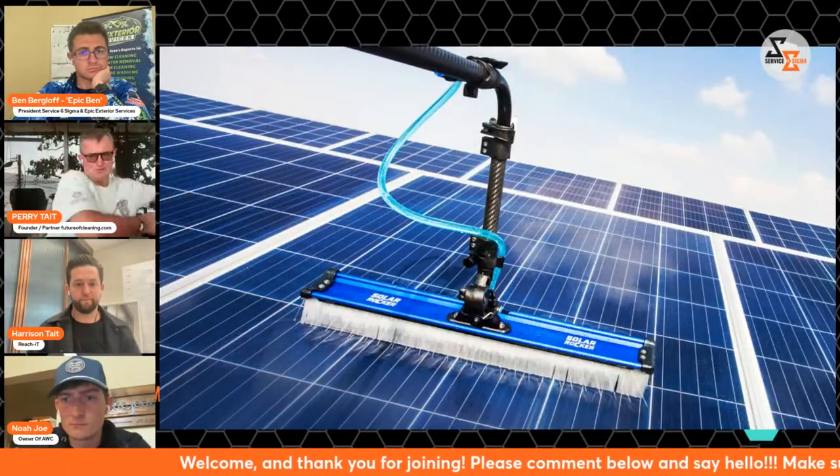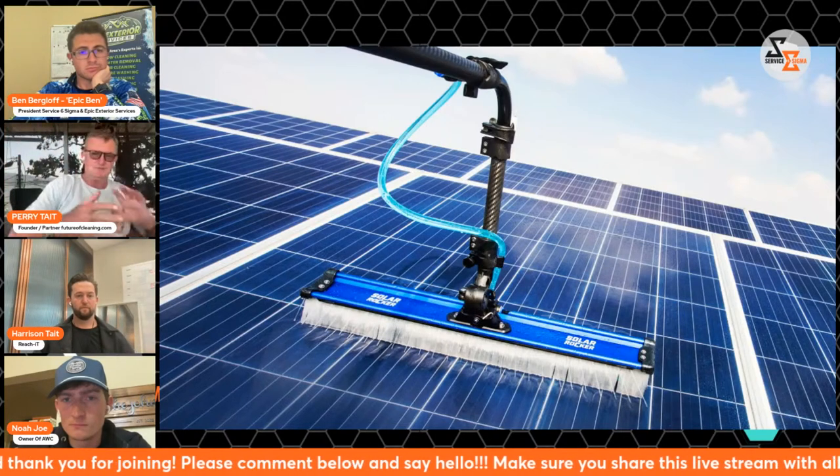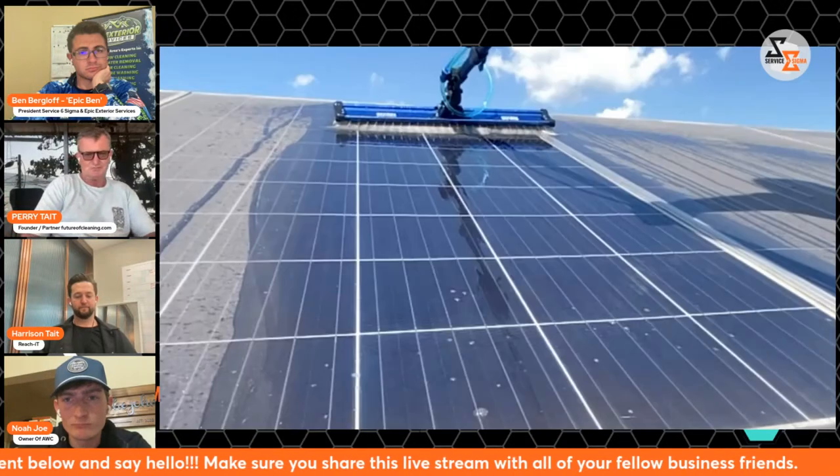The other thing I'll talk about to understand in window cleaning technique is, if and when possible, full length of the panel strokes. Don't do part of the panel, another part of the panel, another part of the panel. No little scrubby scrubs. As much as possible, try and get from the top to the bottom. Sometimes there are other panels around you, and other times it's not possible. And of course, that's real life.